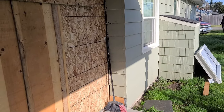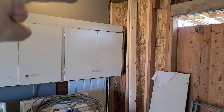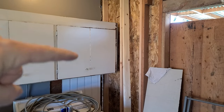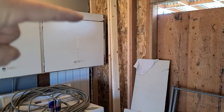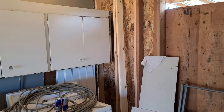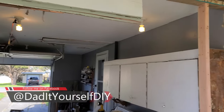On the inside we're going to actually take down these cabinets. We have to peel back this wall to the next stud — there's some damage in there, we need some insulation and all kinds of stuff. So we pulled all this down so we can reframe for the door.